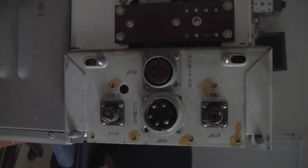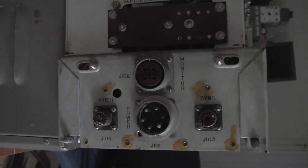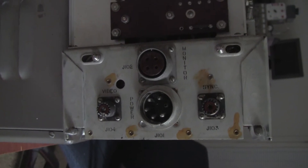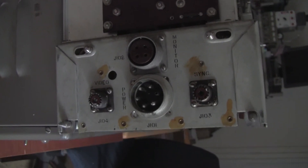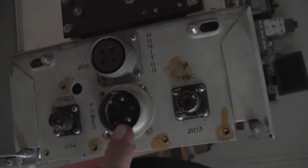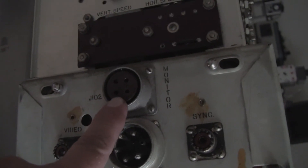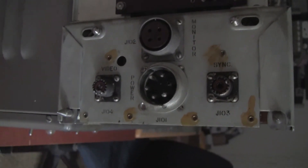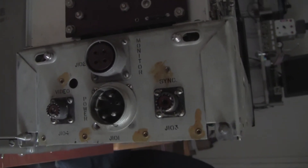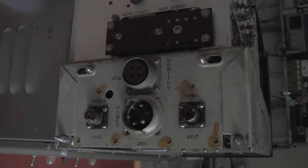Here we see the connectors. For operation in its normal designed mode, this camera worked with several other large black boxes — a power supply unit and a radio transmitter, with antennas and all of the associated cabling. The power supply attached to the camera through this large six-pin connector, and the transmitter or monitor was attached to this connector which sent video and sync. The video and sync outputs are separate; the sync was sent separately to the transmitter so that its amplitude could be adjusted to stretch the sync, compensating for the low power and range.